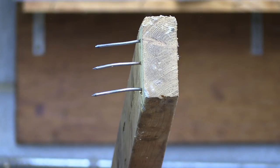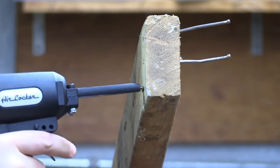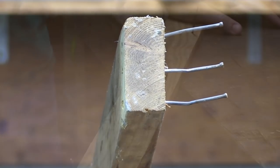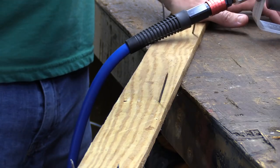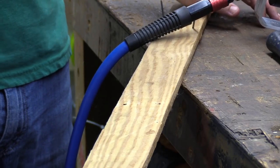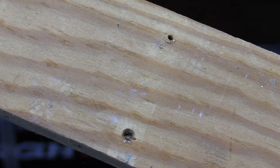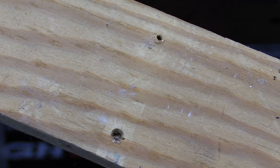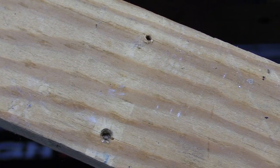As far as problems or issues, I've only run across two worth noting. With larger nails and thicker lumber such as 2x material, sometimes the nails don't eject fully out the other side and you'd still need to go back and pry those out the rest of the way. But the biggest issue I see people having is the physical size of the hole left by the driver when it punches the nail out. Comparing it side by side with a hammer, you'll quickly see which one leaves a cleaner surface — the hammer only leaves a hole the size of the nail, where the AP700 leaves a hole the size of the driver. So if you need the wood to be as clean as possible, that is something to keep in mind.